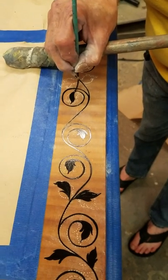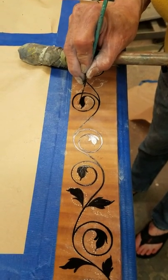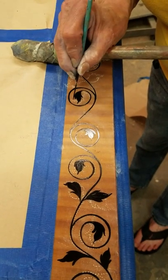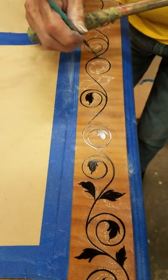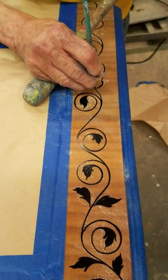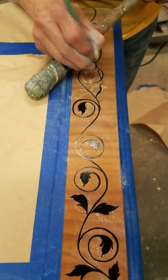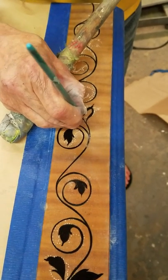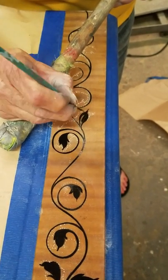She's done about three quarters of the way around the cabinet, and I figured I'd like to just show the people how Sandy does it. She's using oil paint. This is going back on John Whittacombe's cabinet — somebody was playing with the top before it came to me. The customer wanted me to refinish it because the top was all cracked, so that's why the cabinet's here. We got her all completed and rubbed out, looked like a million bucks, and then the owner said he'd like to have the ivy leaves put on. We wet sanded the top down good, cleaned it up, Sandy made a pattern, and she's almost done with it now.